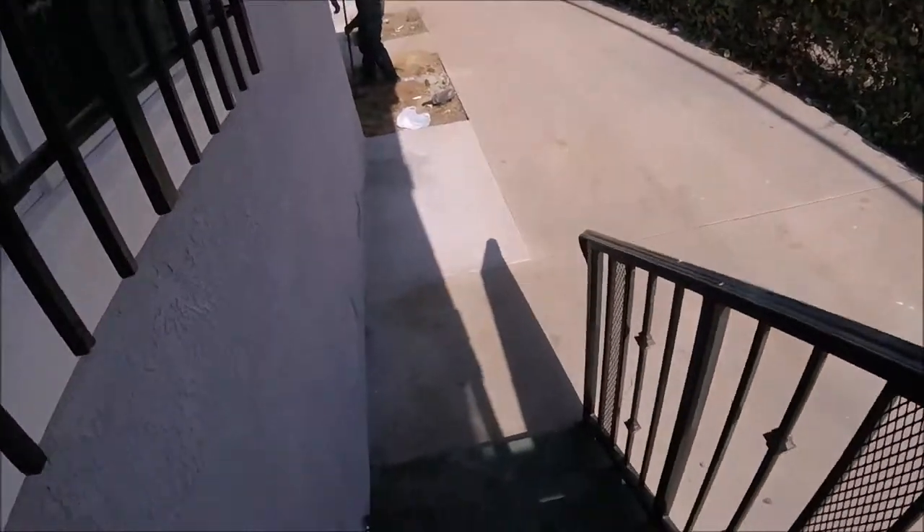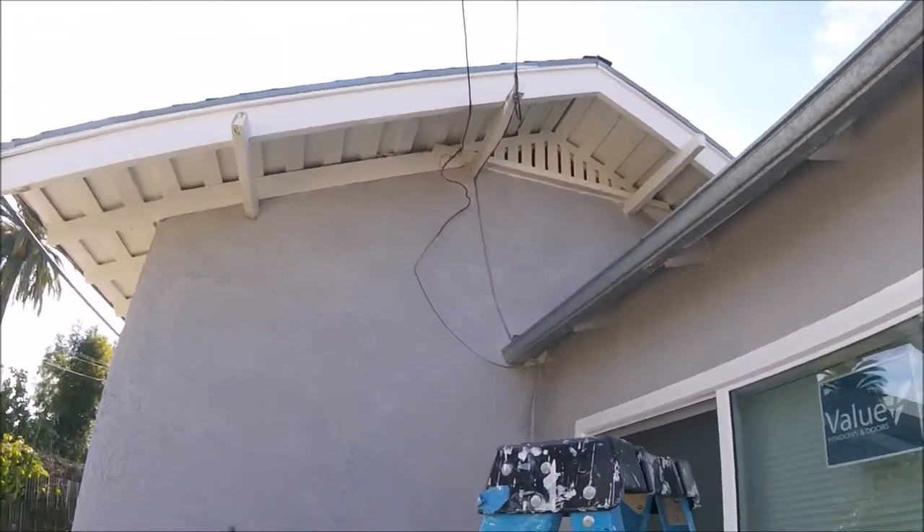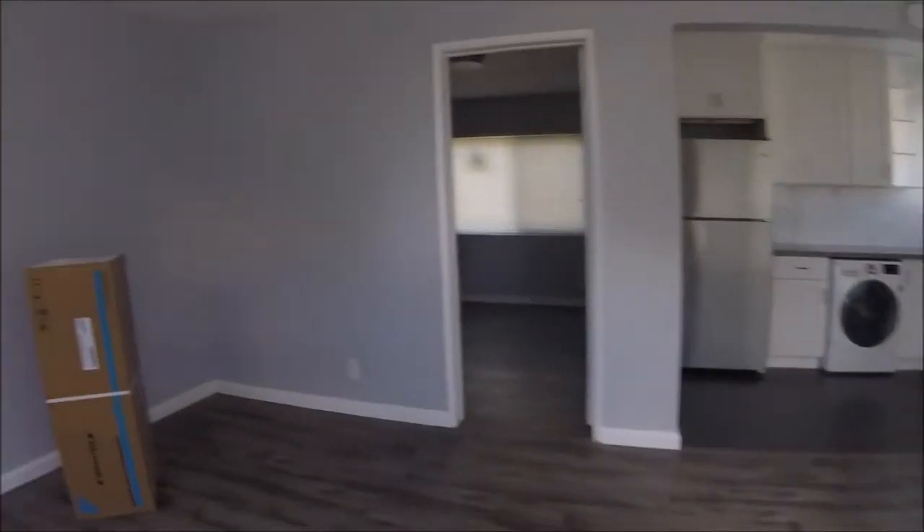Now I'm going to come back and show you the back house. There are two separate units and two separate meters, so they have to have their own condensing units. There's a front house and this is the back house. This unit is going to have just one head mounted right there where I'm pointing. I ended up going towards the left with the line set. Here's the attic access for the back house — it's in the bathroom.